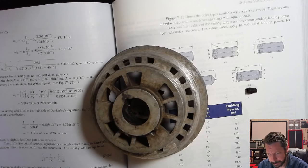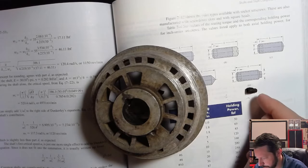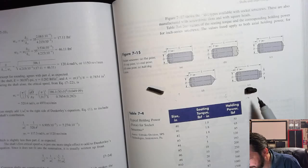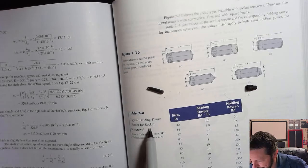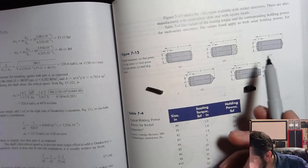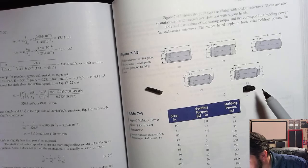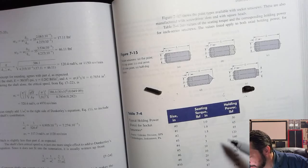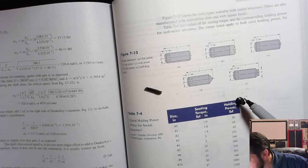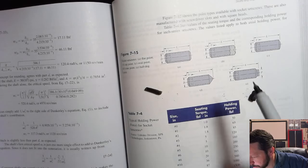You'll often see a set screw here and another set screw 90 or 120 degrees from the first one to help constrain the pulley on the shaft. In your book, you only have a chart that shows socket set screws — the cup point style — so instead of having a protruding tip, they have a little indentation that cups inward.